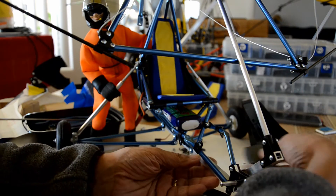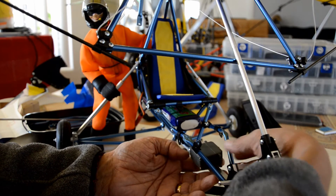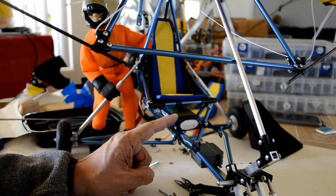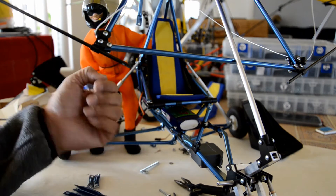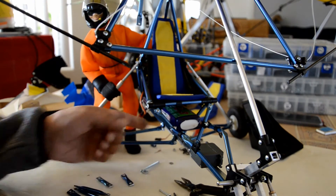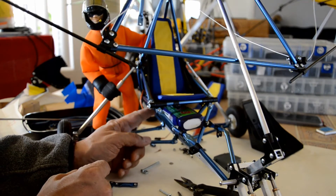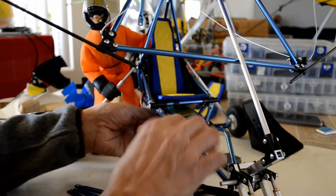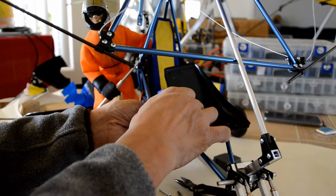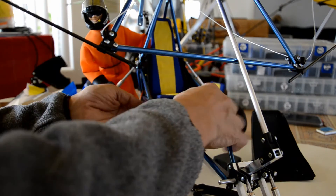The servo will come back to its original place — this will be the steering servo, no need to change that. I had to remove it because I was originally thinking of putting the battery further forward, and I even machined some spacers to widen this up, but it's not necessary. I really want to install the battery through the back and just slide it right through, so the cover will have a strap, and once the battery reaches the seat, the seat itself provides backing — it's not going anywhere.